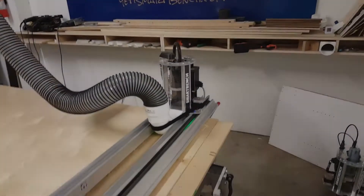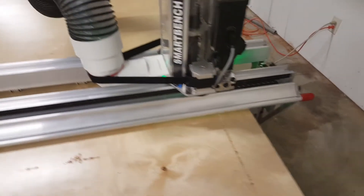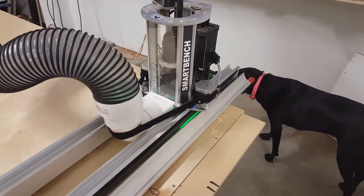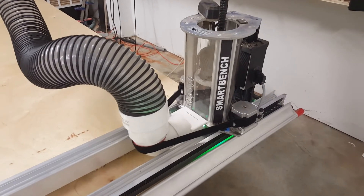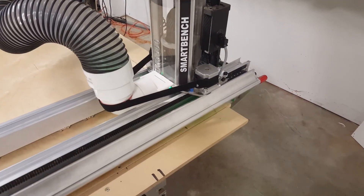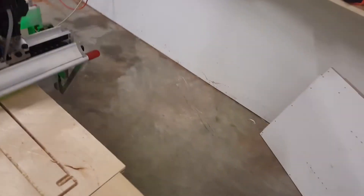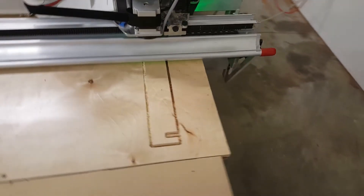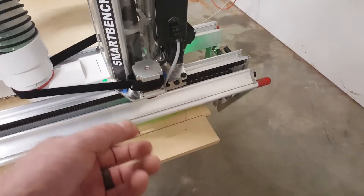This is the first test cut of the new dust collection system. Two straight-flute Freud bits, a quarter-inch depth of cut, half-inch material, two passes and it'll be done. I didn't do a return onion skin — I may have — but I'm just testing the fit right now. I can tell you there's no debris on the field. There's some in the kerf line, but that's it. The second pass is taking it all out. This first run is just checking to see if the slip joints are going to fit properly, then I'll do tool adjustments to make it fit just right.